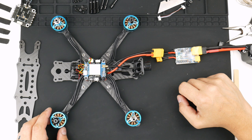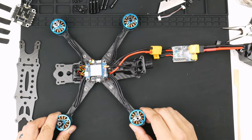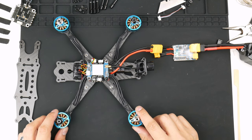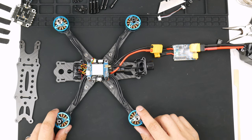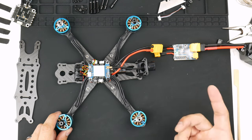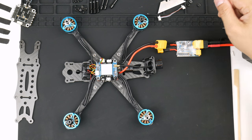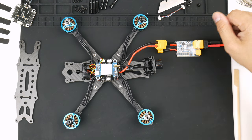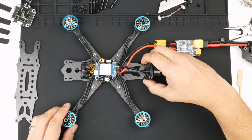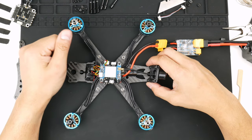Three, two, one — there you go! The flight controller is powered up; I can see the LED underneath there flashing. The video transmitter is also now flashing those sequences of LEDs that indicate the power rating and channel frequency band it's on. Everything is all wired up and there's no smoke. I hope that helped someone out there. If you have any questions or comments, please put them below and I'll try to get to them.